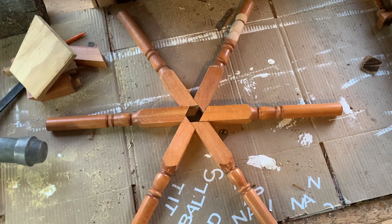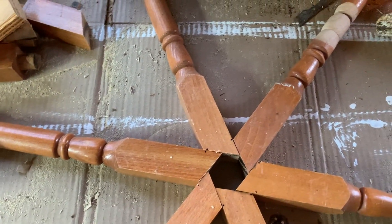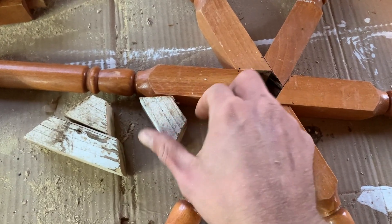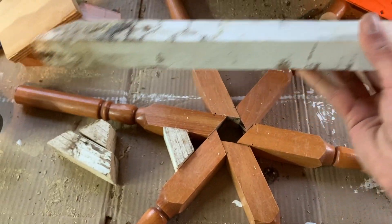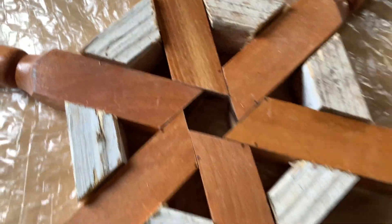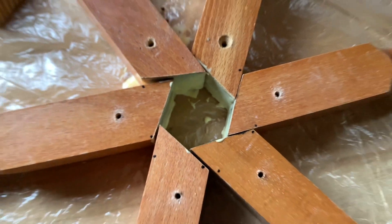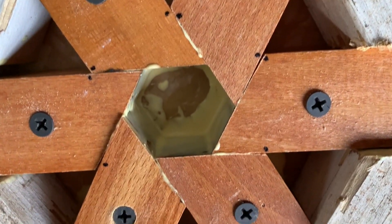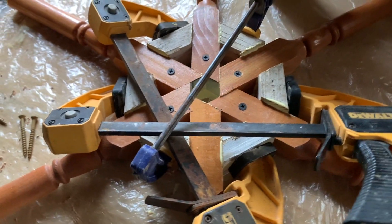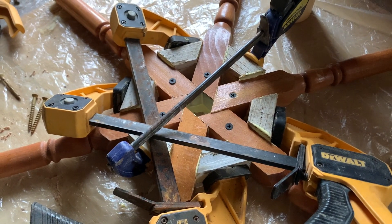The handles are a little too long — I'll cut those later. I put some bracing in between using little pieces of scrap wood from an old chicken coop, cut at about 30 degrees on each side. I put down some plastic, glued the pieces, placed them how I wanted, then drilled holes through the handles into the sacrificial plywood on the back. I screwed the handle boards down and clamped the braces in place with everything glued.